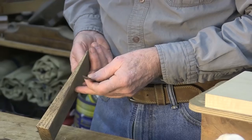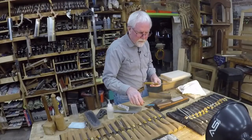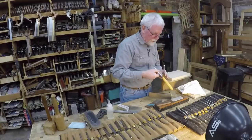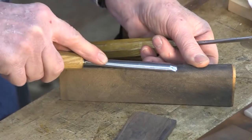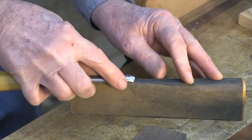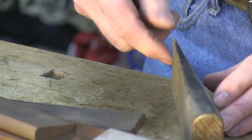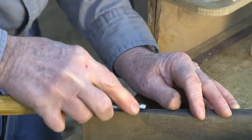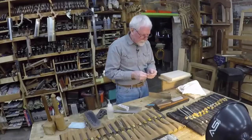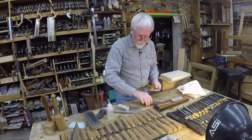I made up a conical shaped strop that's wider at one end. If I'm trying to strop a wider chisel, I can use it higher on the curve; for a tighter one, lower on the curve. So I can use this for a variety of different sweeps of the different chisels. I can usually tell by the touch when it's ready to go.